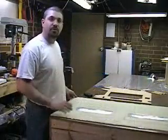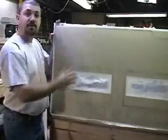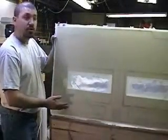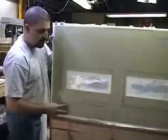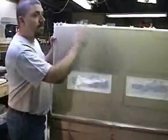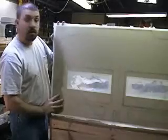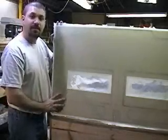This began by making your foam base structure much larger than needed. If you look through the final fiberglass, you will see the foam shape for this instrument panel is much larger and really unshaped. You can see where I've added three foam pieces in to save and conserve foam. As for cutting the actual shape of the top of the bulkhead and cutting the leg holes around the bottom, I left those all together. I then fiberglassed both sides oversized and cut it to rough shape with scissors down to rough shape while it was still in the epoxy stage. You can see this is a very rough shape, but it's going to come down to that final shape very quickly.